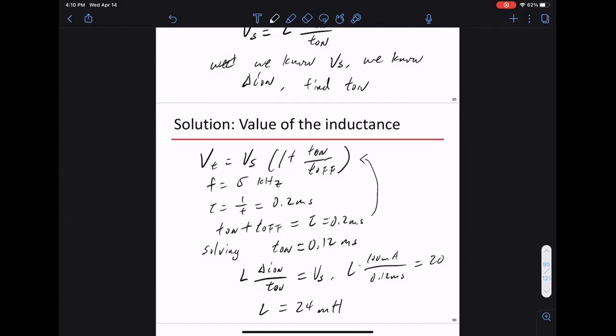Are we also assuming that the voltage across the inductor doesn't go to 0? Right, so we're going to assume the inductor is large enough that we don't saturate it. We're going to stay far away from the regime where you saturate your inductors, so linear behavior, and that you don't have reverse current flow. Again, the capacitor is large enough. These are good questions. These are very practical things you need to consider when designing these kinds of converters. Here we're presenting a simplistic viewpoint of just worrying about the average and the current ripple, but in practice you have to care about a lot of other things.